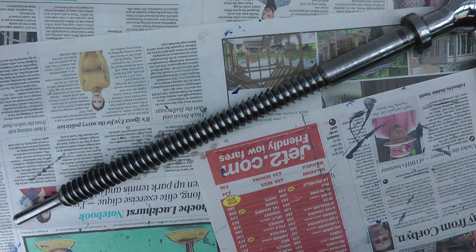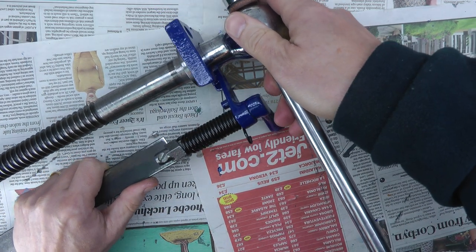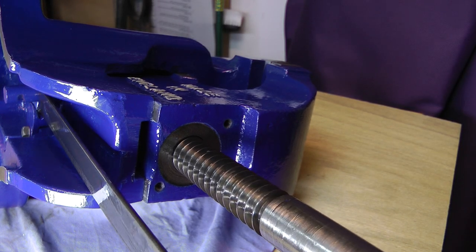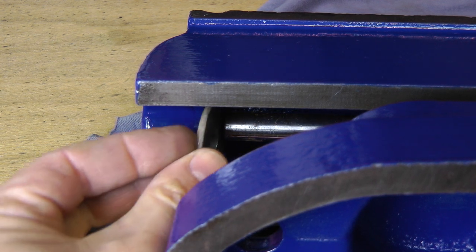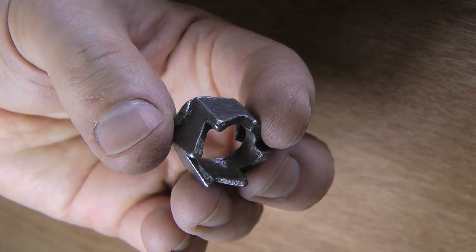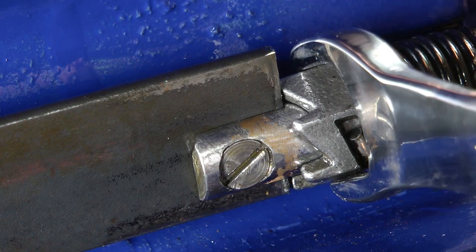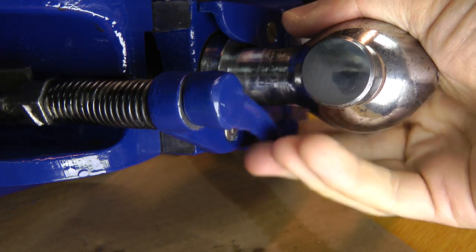I used ISO 68 slideway oil as I already had some on the bench. It's a bit stickier than general purpose oil, which should help it stay put and not just run off. I hooked the quick release mechanism on and then offered it up to the vise. I engaged the rocker bar whilst sliding in the screw, not forgetting the washer at the back, just before the screw was fully home. I secured the front bracket with two new slotted screws. The castellated tensioning nut looks to be cast, so I modified a really cheap 18mm spanner to fit rather than risk breaking it with grips. I turned it three flats to get a nice feel — not so tight that the screw will wear, but not so loose that the nut disengages when the jaws are tightened.